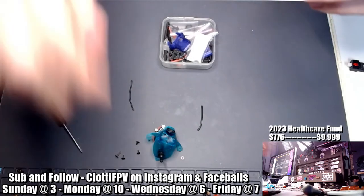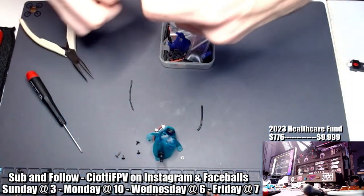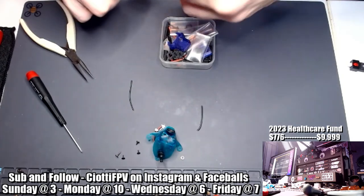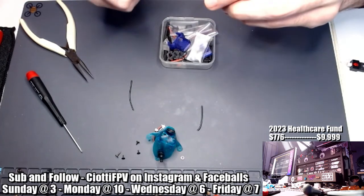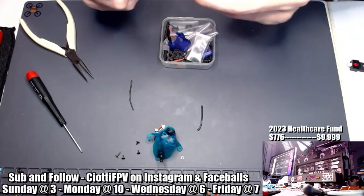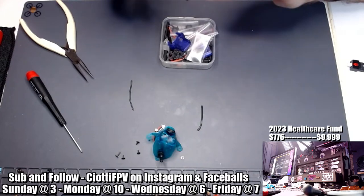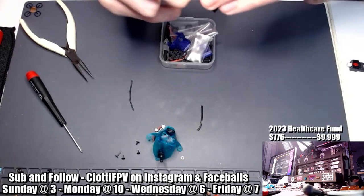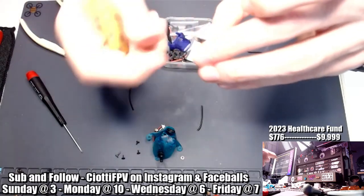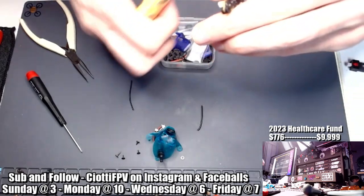And see, so now... Oh, shit, it's not long enough. When you stretch it, it gets a little bit shorter, right? What if I use this piece of clear shrink wrap here? It's a little too big, and it's a little too long, so let's just cut it down a little bit. All right. This is really thin stuff, which I don't usually like, but hey, what the hell? Let's give it a shot. Okay. Back it off a little bit there and hit it with some heat. And then I like to just kind of pinch the end like that, just to kind of close it down. And you can also seal the shrink wrap if you do this little thing while it's still hot. The shrink wrap will literally make a little seal. It's kind of nice.